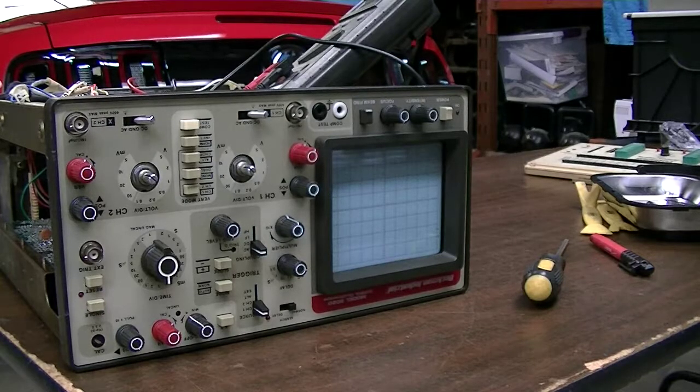I decided a few weeks ago while on vacation to pretty much completely disassemble this and clean all the controls. While I was in there I ran an ESR tester through a lot of capacitors. Most were pretty good, but the really low value ones — like the 5 and 10 microfarad capacitors — were high, 10 to 20 ohms, so I changed those out. I also replaced a small relay, got it all back together, and everything worked really well.